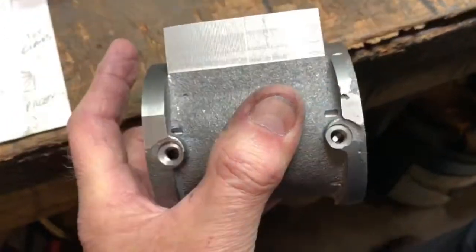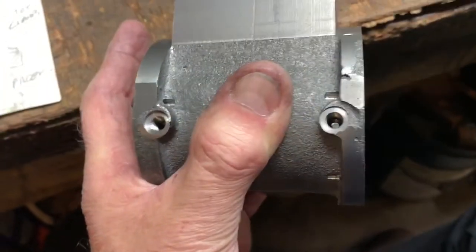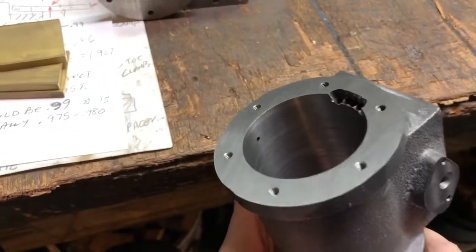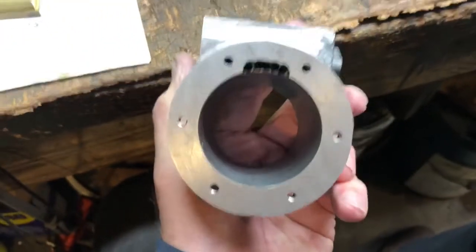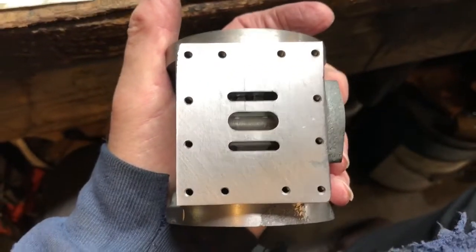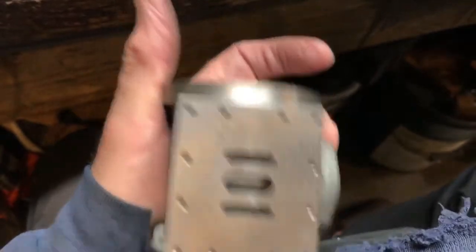It's 3.25 inches long. The ports you see here are for the cylinder drain cocks — they're 1/4-40 monotaper pipe and they have a small hole drilled through into the cylinder to let the steam out. The cylinder caps attach with 8-32 screws, and those holes are all tapped. The steam chest attaches to the steam chest face of the cylinder with 6-32 screws.